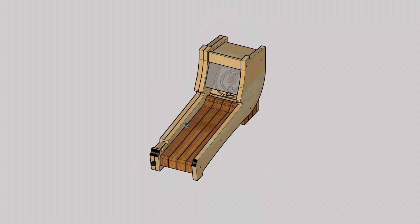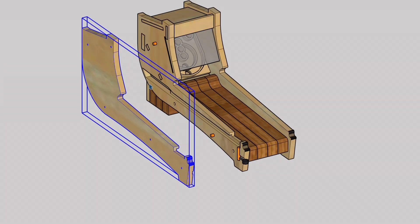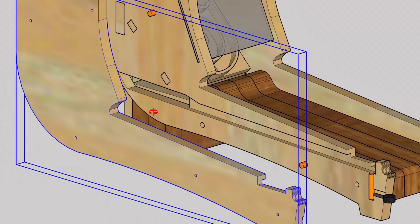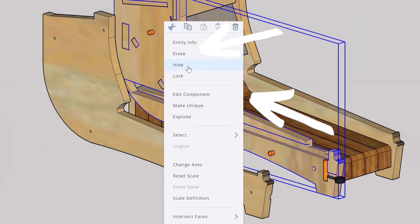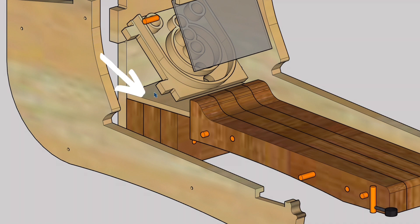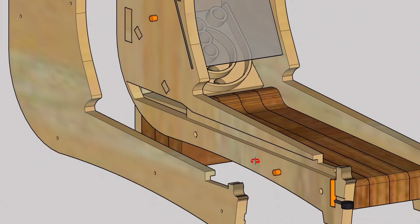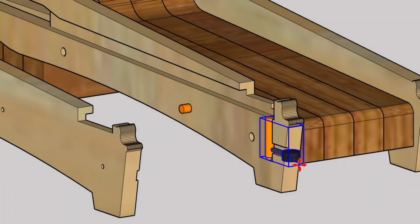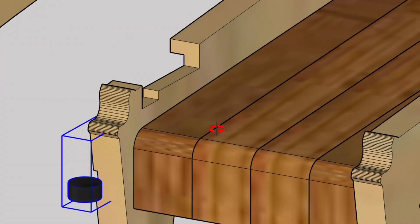If I take a closer look at the design, you can see that these pieces come off one another. They're going to be screwed together, and tucked away in there is the ball return. My plan is to have the balls roll up, go into the goal platform, and behind there is a tilted ramp that guides them into a channel sandwiched between the two side panels, with a slight decline to the front so the balls come to rest right there. This little lever in the front is a nail tied to a little piece of wood and dowel — slide it up and down and it should pop the ball up so you can get it with your fingers since it's going to be so tiny.